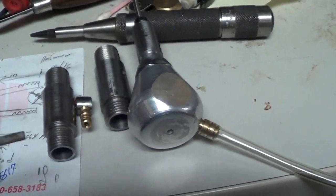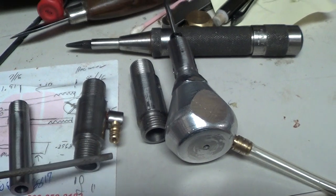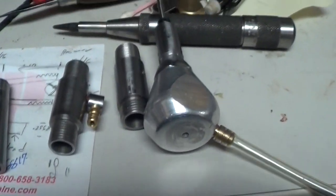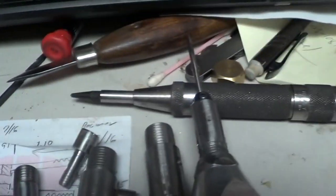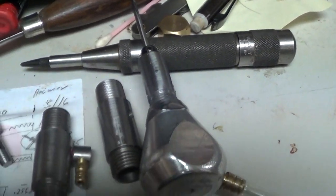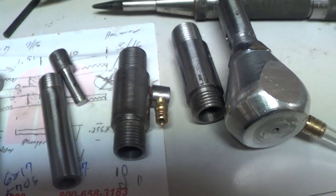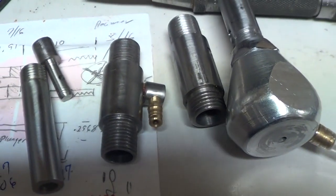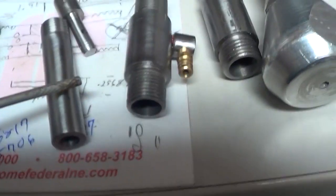So this one here was my second attempt for an air graver using a piston system. Here's one of the pistons — the air goes through here and then it goes through a sleeve and reverses the pressure and pushes the piston back up. It's a unique, simple push-pull type graver tube, and it supposedly works about five times better.